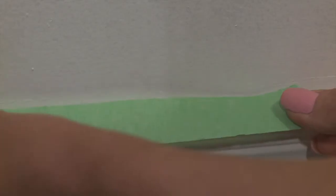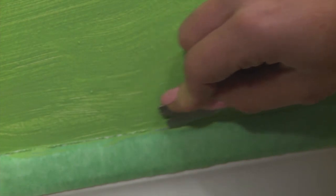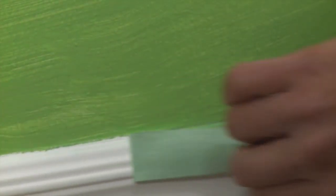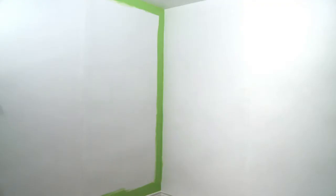If you don't have a steady hand or like the added protection, you can tape all the edges with painter's tape. Just place the tape on the edge against the wall and cut into it like normal. Then, once the paint has dried, gently run a razor blade in between the edge of the tape and the wall to ensure a sharp edge. Repeat this process with the ceiling, door frames, and corners, and then you are ready to finish the wall.